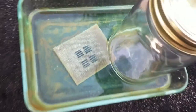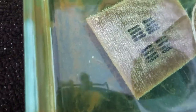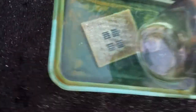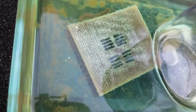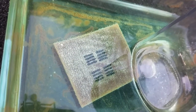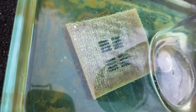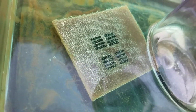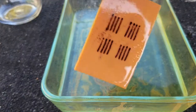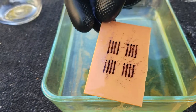Two things to note here. One, you may want to set something on top of the board if it keeps floating up — mine was, so I have a glass jar sitting on top of it to keep it below the level of liquid. Second, be careful not to touch or agitate those Sharpie marks, because I did that before and I had to make a second board — the copper was inconsistent and the lines would have been broken. We have almost all the copper off now, so let's go rinse this off and take it from there.